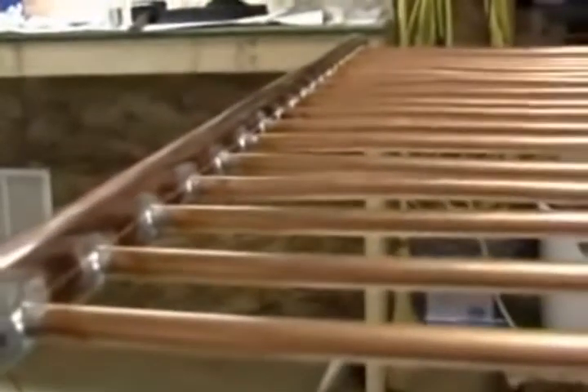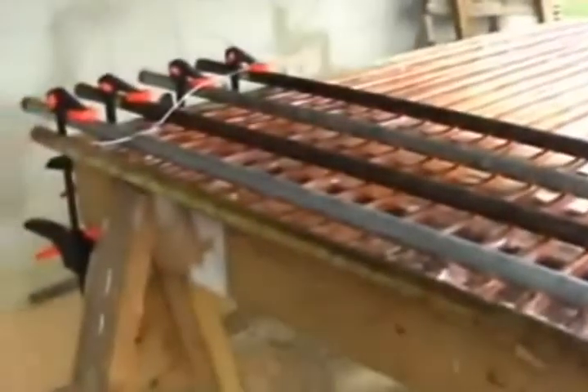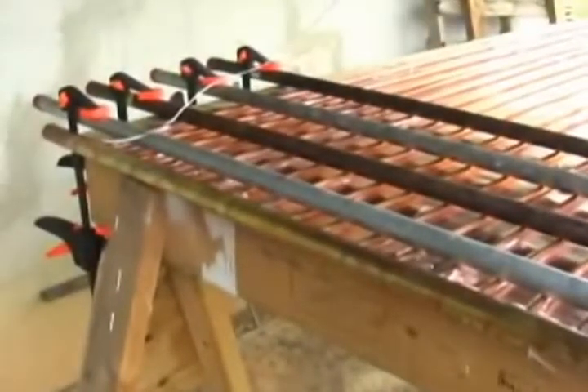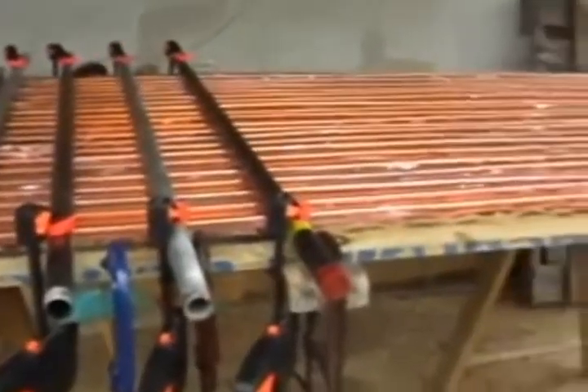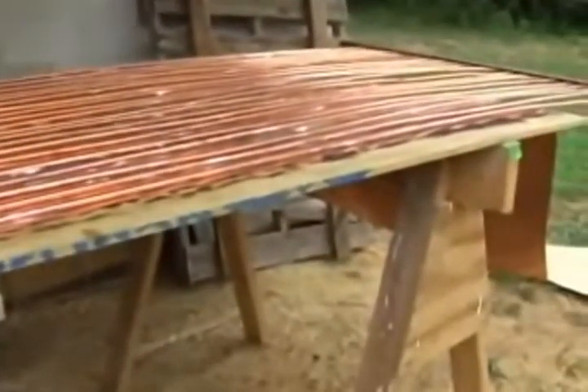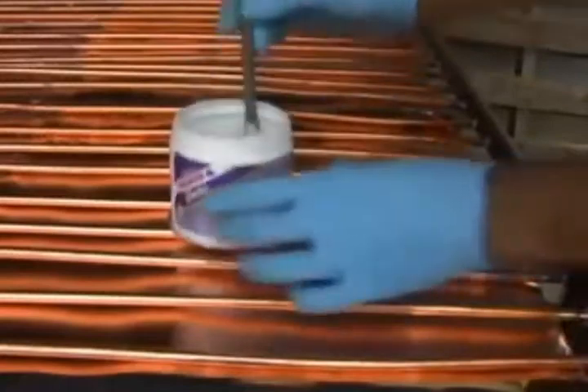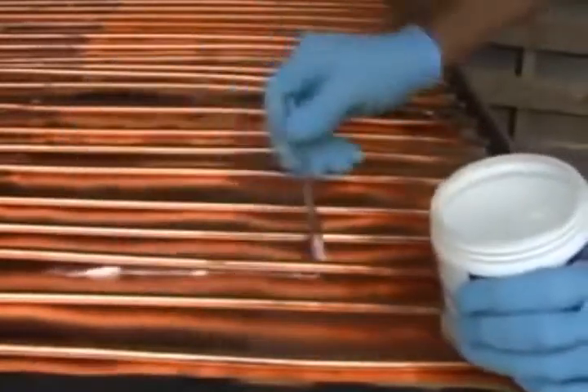Soldering headers indoors is okay, but the next step — soldering a 5-thousandths inch thick copper sheet to the copper tube — is best done outside due to the amount of smoke you will create. Press the copper sheet securely against the copper pipe; I found a 3/4-inch black iron pipe did a reasonable job. Have lots of solder available. I use 50-50 lead-based solder and a water-based flux for this part of the project. This jug was good for about 3 solar panels.